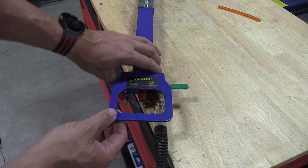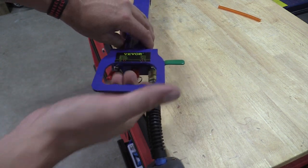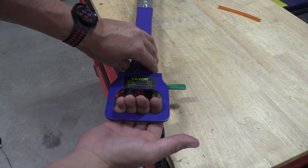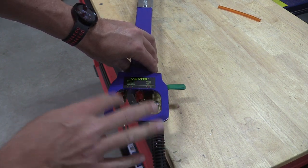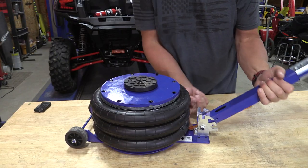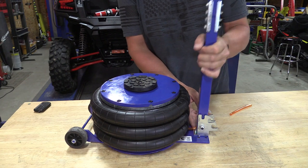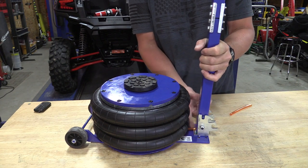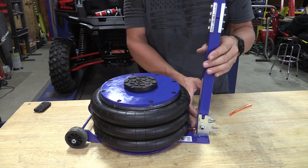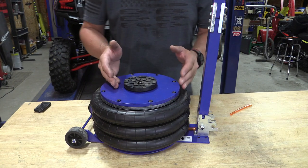I expect a little bit more. The handle is just CNC'd out, very thin — it is not comfortable. It's got sharp edges, so if you're pulling it around, gloves are nice. There could be a lot more done here to make this comfortable. We also have this tube that runs up against the bolt that holds the handle in. It doesn't get crushed completely, but it is definitely up against things, so eventually that's going to leak. Keep an eye out for any leaks there — that's going to be a major problem.